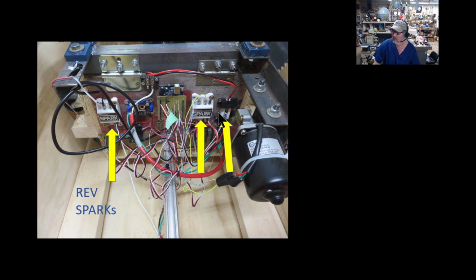I really would recommend, if you're going to build this particular device, get these ordered, start playing with them, and with the code. They work great. The only problem I've ever had with these things is if you have an LCD monitor. Sometimes the LCD interrupts will interfere with these servo controllers, and you'll get a little jerking and movement that you do not expect. But there are software workarounds for that too. But I'm not using any LCD in this project, so it was not a problem.